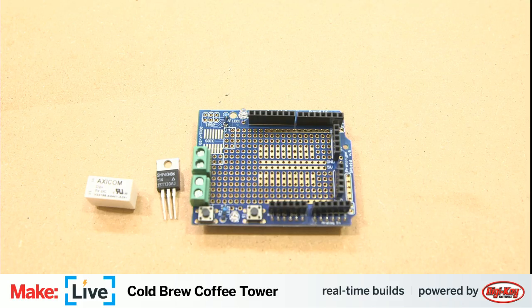Now, typically when you make cold brew, it's like a drip a second. The issue with that is if you just get a little ball valve or a petcock valve to control the drip in a cold brew, what I noticed, I have a nice little setup from a Japanese company called Hario, it really varies. Like you'll tell it to drip every second and you'll set it and you'll go away and it just drifts a little bit and all of a sudden it's like twice as fast that it's dripping or it's slower. So that was actually the primary motivation behind doing it with this seemingly unnecessarily complex solenoid, is you can actually control pretty exactly how long it's going to take for it to drop that water through and brew the coffee. Yeah. Okay.